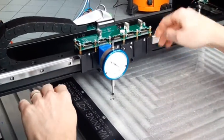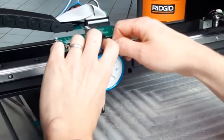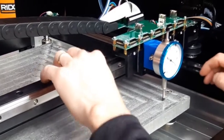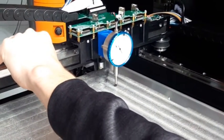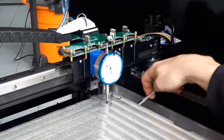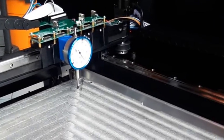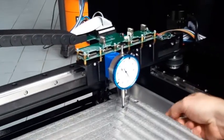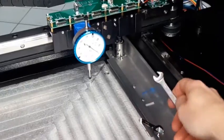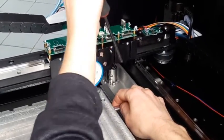We're going to get our first rough zero reading close to our pivot hole, and I'm just going to turn this indicator to zero. The back side is a little off. Make sure your lower standoff is tightened to the bed, then tighten the upper standoff. As I turn the wrench it changes the height, so get that close. When you tighten down the locking screw it can move it a little bit, so there's going to be some trial and error to get it as close as you can.